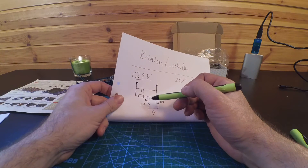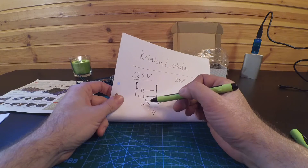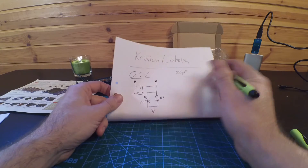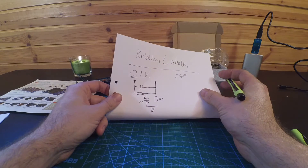Let's start with 0.1 volt. I'm going to desolder C5 that's there and I'll maybe try to put it in the same place on the surface mount pads, but if it doesn't work I'm going to put it in parallel over R3 — that's where I have written down for myself to know about it.